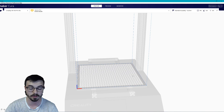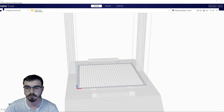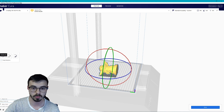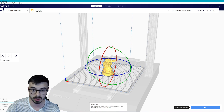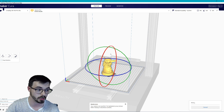I have a video detailing Cura settings — go check it out. So here we have our slicer, Cura. I have this nice STL file of Baby Yoda. I'm going to drop it into my slicer program. Here's our Baby Yoda, and this is exactly how it came in. You do not want to print it like this — use the tools on the side to rotate it 90 degrees. That's how you want to print it. Then you hit slice, and depending on your computer speed, it'll slice faster or slower.